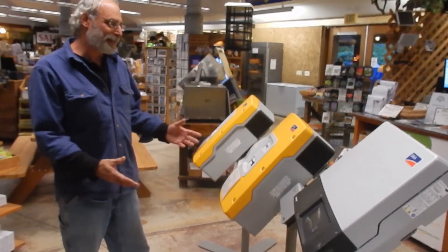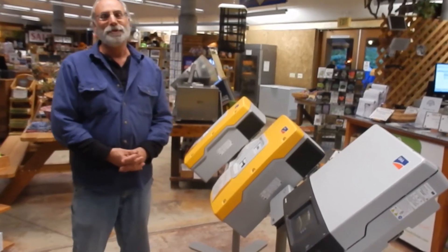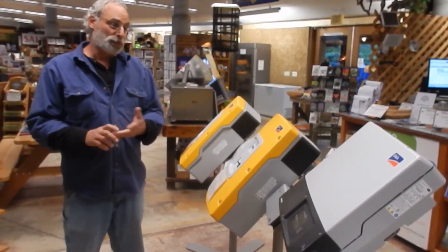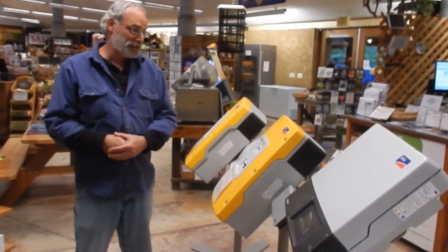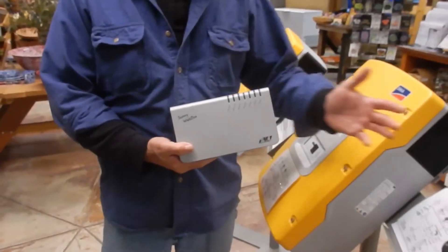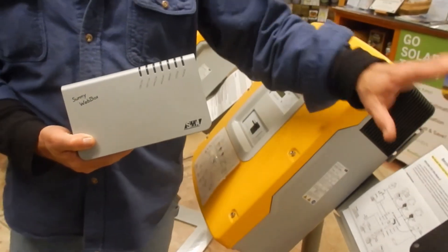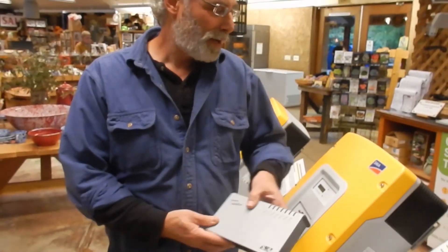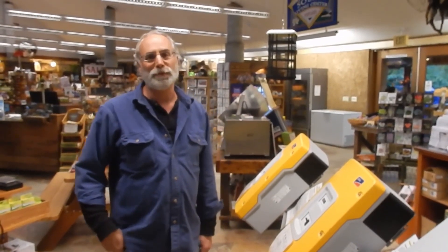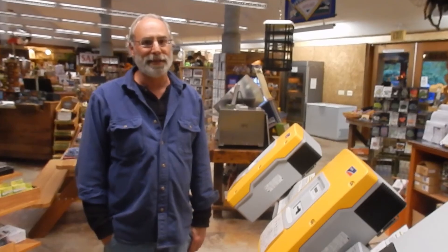What really makes the SMA system special and work so well is that it has a communication protocol. When the batteries are full, the solar panels are in the sun, and the loads are less than solar production — which would normally be a big problem in an off-grid system — the Sunny Web Box is the brain of the system and manages that power. The Sunny Boy inverters can throttle back, forcing the solar panels to work closer to their open circuit voltage and produce less power until a compressor, pump, or other load comes on to balance. Then immediately the power from the solar panels is allowed back into the system. None of the other manufacturers have that control system.